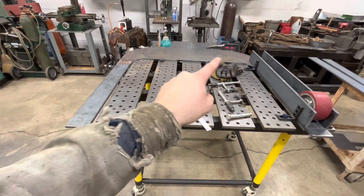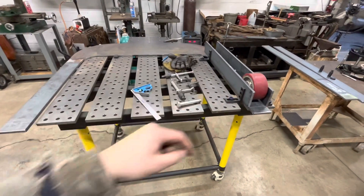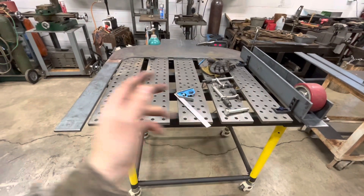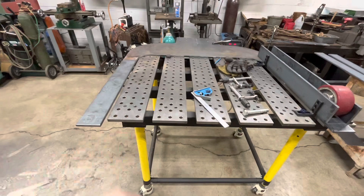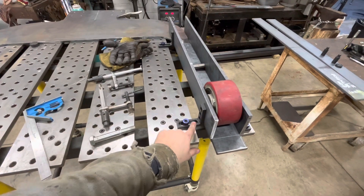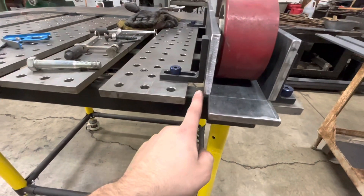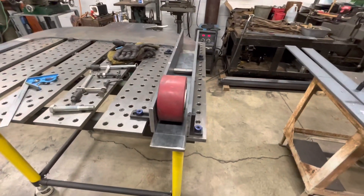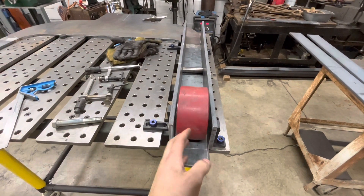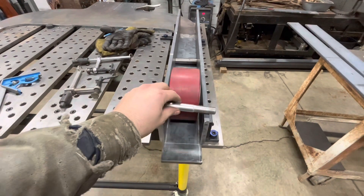I have two stops there to keep the back plate square to the table, which means all of the runners are now square to it. As you can tell this side is overhung, so I'll shift everything over and set up my stops on this side. These little stops, clamps, and squares on the Build Pro — I can set it up in a couple minutes so it's square here and square along the length. The main concern is getting this front caster wheel in here with a little bit of wiggle room, and I'm also going to have to punch holes and put the bolt through it.